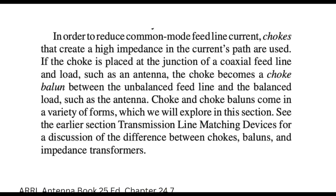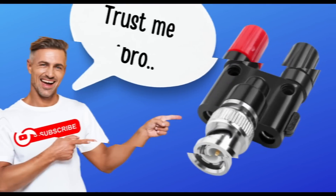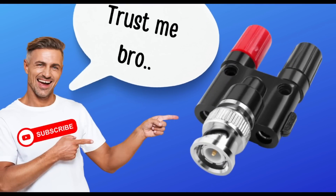If you really want to learn about this stuff, pick up this book and read the entire chapter — heck, read the entire book. A lot of times we'll see somebody on the internet saying "Trust me bro, you can just build yourself a quick and easy dirty $5 dipole — pick up one of these BNC to banana jack connectors, connect your coaxial cable and a couple of wires, and Bob's your uncle." When I see people do this, I ask them — sometimes to my detriment — how are you handling common mode currents, and what kind of choke balun should you be using with this? You should ask those questions too.